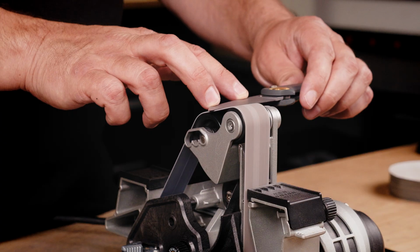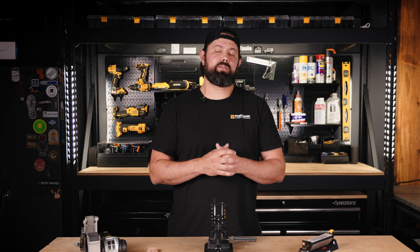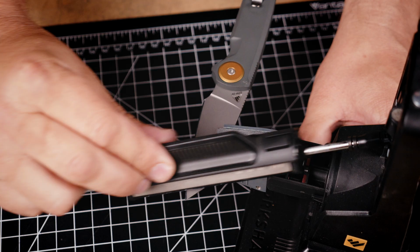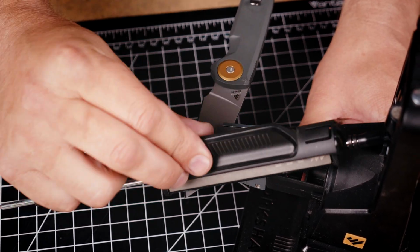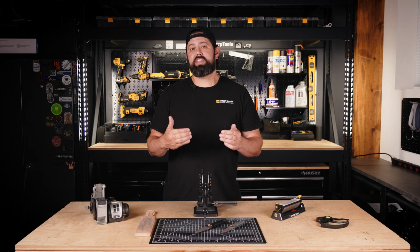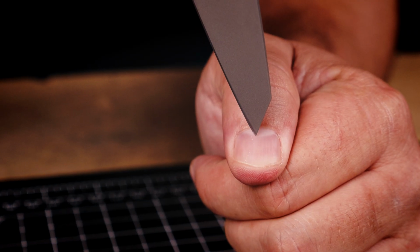No matter what system you sharpen with, one key tip to keep in mind whenever you're sharpening any reverse Tanto shaped blade is to watch the tip. Abrasives tend to want to round those off. So make sure that the abrasive's moving straight into the edge at the tip and not rounding that off. If you're using a powered system, be sure that belt doesn't get a chance to wrap around the edge, rounding the tip as well. This will make sure the tip of your knife stays sticky sharp, just like a cat claw.